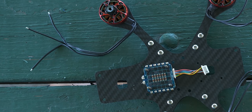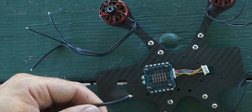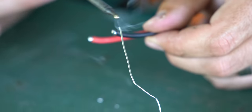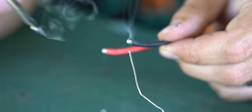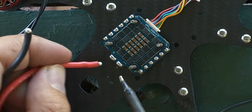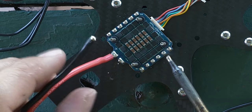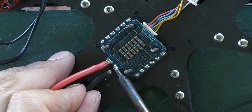While we're here, we can put on the XT60. Pre-tin the XT60 leads by applying heat to both things and adding a little extra solder until it's nice and wet — same on both sides. I'm running the XT60 straight up the back at a slight angle since the battery will mount on top. Heat both the wire and the pad at the same time and it drops right on.